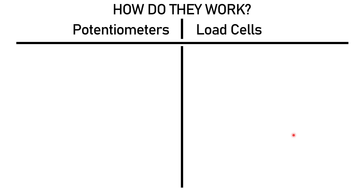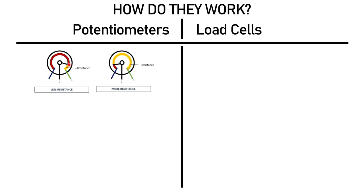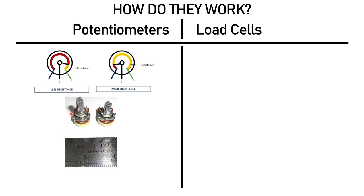To get to the point, I need to explain how both pedals work from a mechanical and electronic point of view. So potentiometers — you input your voltage, and you have a resistance which changes depending on the needle position, which changes with your pedal travel. If you have more travel, you have more resistance, so you get a smaller voltage. That's how your computer knows if you are at full throttle or no throttle, full brakes or no brakes. It is a travel-based measurement.